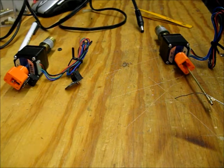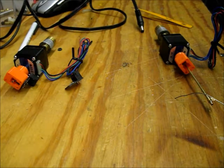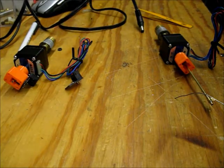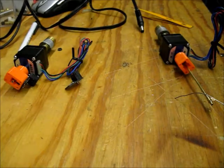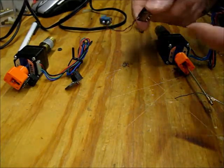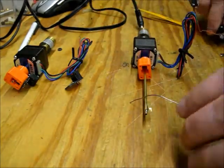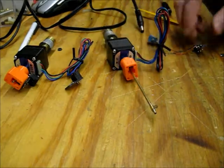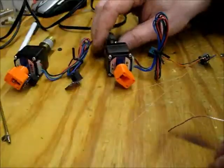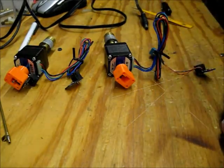The more I think about it, I think I will put the heat shrink on. It's cheap insurance. If I happen to snag the PCB and rip on it, I don't know if these pins will pull out of the body of that first, or the pads out of this guy first. So instead of risking it, I'm just going to heat shrink it and hope for the best.